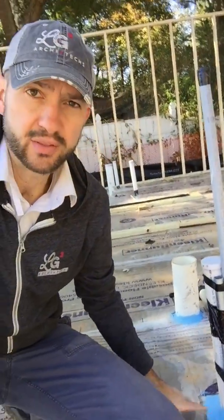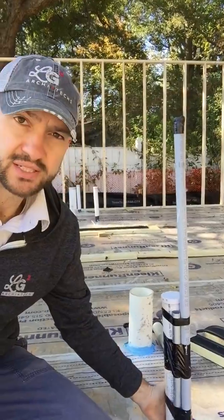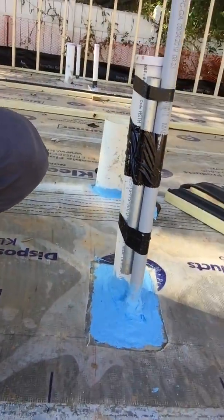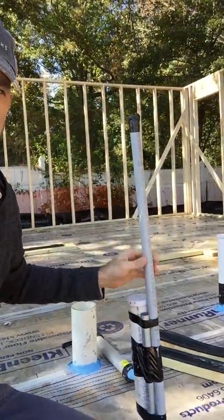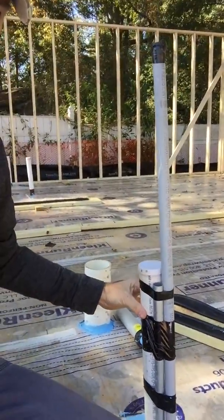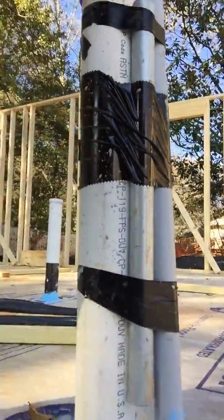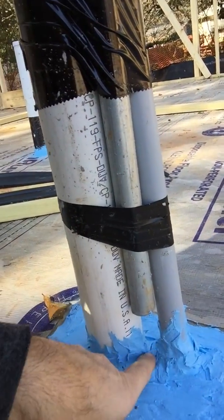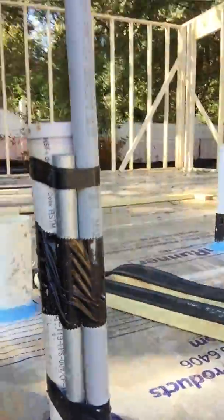Because these penetrations aren't perfect, we want to seal those things so we don't have any air leakage happening through the slab. This is our typical way we deal with a penetration where we have multiple pipes. You can see this is an electric conduit here and then this is a plumbing pipe here — you can see how close they are together. Normally they would run these two pipes literally touching, and that makes it pretty difficult to get your air sealing product in between. This way it allows us to get right in there between the two and make sure we have a perfect seal.